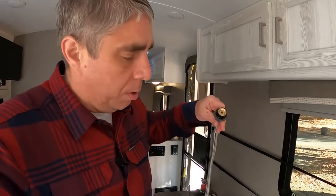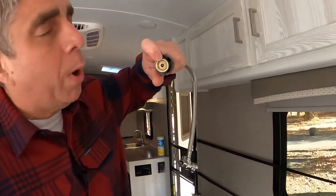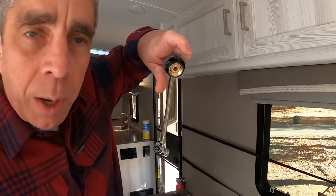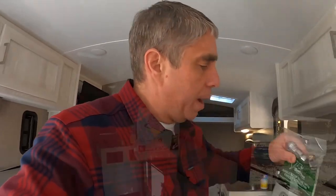On this one, what I have is a half-inch IPS out, and that should connect perfectly with the kitchen faucet I have. Essentially what they're measuring is this half-inch thread size where it threads to the old faucet, and then there's an inside diameter where this little white plastic piece goes and snugs up in there — that's where you get that compression fitting. This is what the bag looks like.